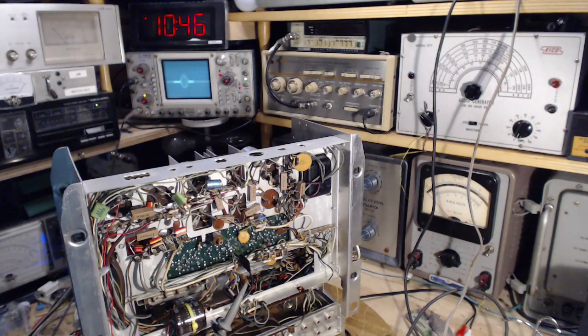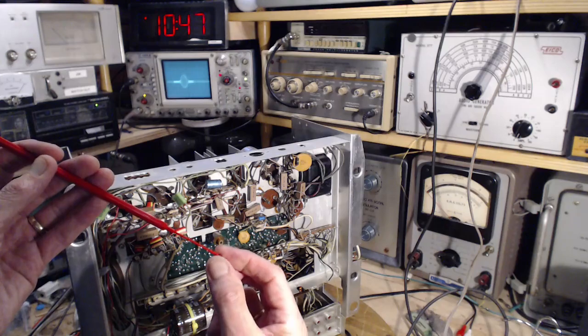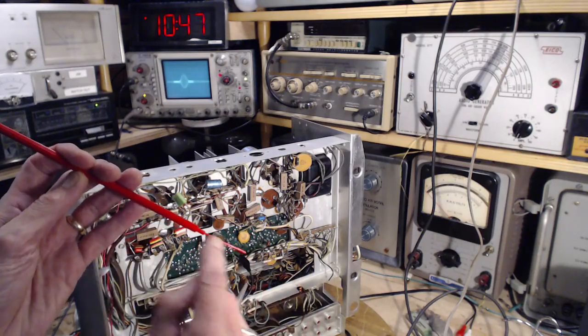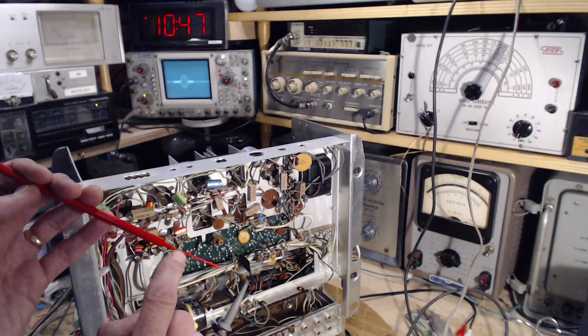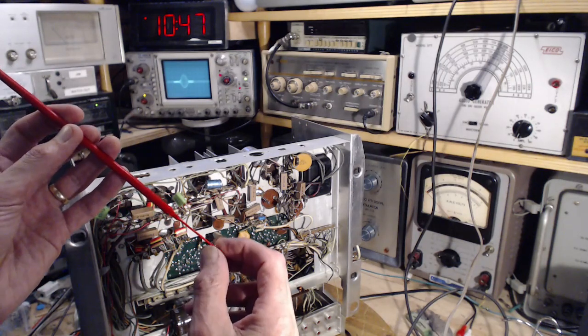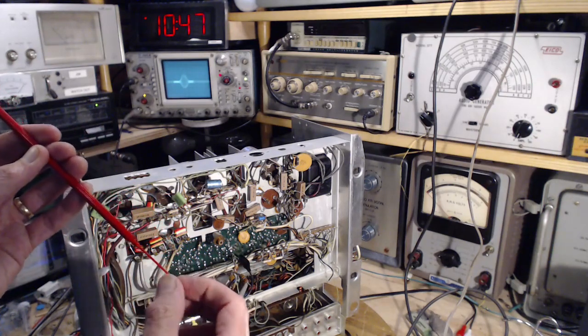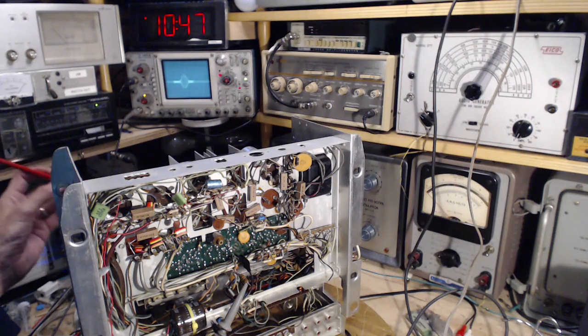The problem with this is the bottom one won't adjust. With this thin piece here, and with this locked, stuck slug, all that happens is you twist this. It builds up strain and tension in here, and at some point, if the slug does turn, it'll snap half a turn or something. It's very difficult to do any kind of precision with this situation. That's what we're in. But let me turn the slug that can be turned and see what it does.